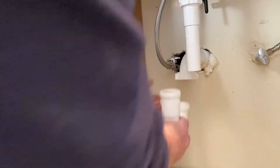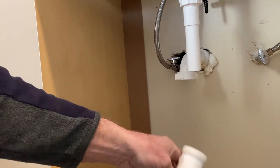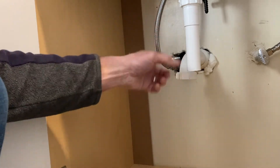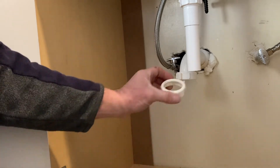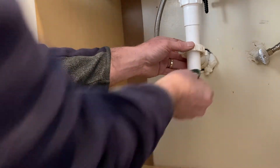Either way, I usually just loosen this. A lot of times if you're just now doing this, it will leak water out because it holds it in the trap right here. So I just carry it there — keeps life simple. This just happens to be inch and a half. They sell inch and a half and inch and a quarter — that's pretty common. Usually inch and a half in the bath. A lot of times the pipe coming out of the wall will be inch and a half and they'll taper it down to inch and a quarter. So they make these fat washers that go from inch and a half down to inch and a quarter. The washer is bigger so it seals off that gap.